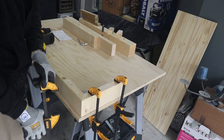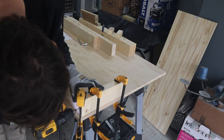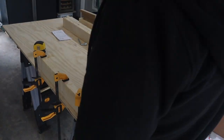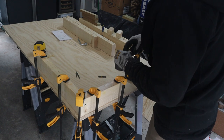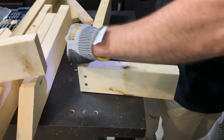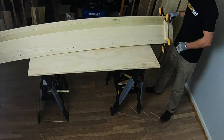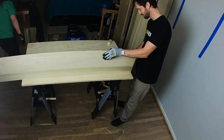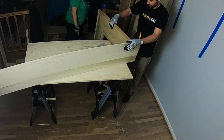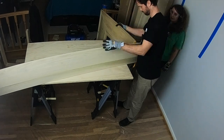We had to cut the frame so we could fold it into the corner, using 45-degree angles to meet the boards together. We clamp them down to hold them in place, pre-drill, and then screw it. The back edge of the corner unit needs some extra support for stability, so we install support blocks. We put down the support bracket and nailed it, then hung the side of the L over our work table to secure the bottom shelf to the sideboard, using a couple of clamps as an assist.